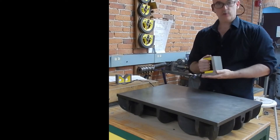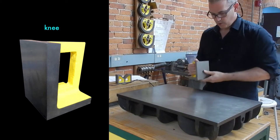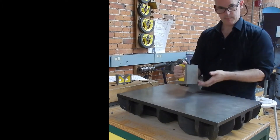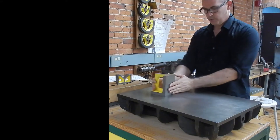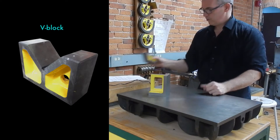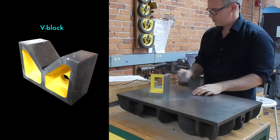There are some additional tools you can use with the surface plate. This is a knee — it's been machined to a right angle, and they generally come in matched pairs. It has a handle built in. Never put it down; always establish contact at the edge and then slide it forward. Anytime you're putting anything on a surface plate, if you put it down, you have a chance of chipping it by hitting a corner or creating a burr. You would use this if you want to transfer your flat surface to a right angle if you want to measure vertically. There's also a 45-degree version — I could put my work in this and have things on 45-degree angles.